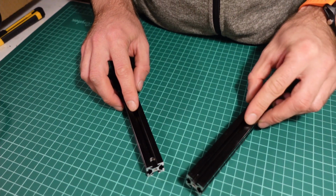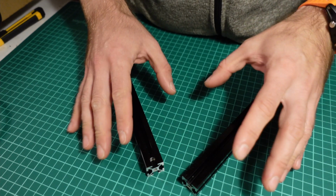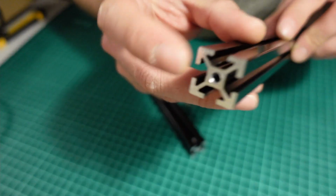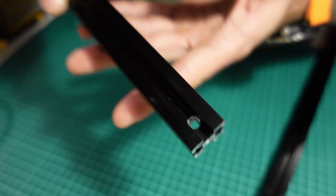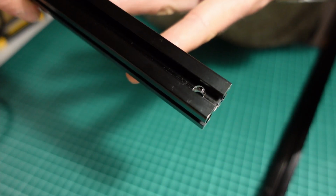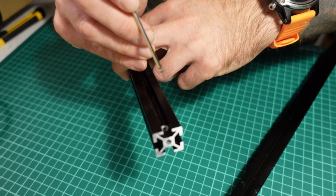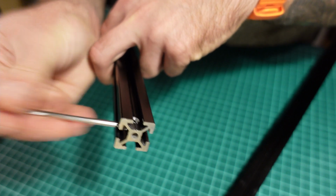Blind joints are the standard way of building Voron's frame. Blind joints means that you do not use any corner connectors or fixtures. Instead, you tap a thread into a center of one piece of extrusion and drill some holes through the other piece. The holes can be a bit off-center or misaligned. They're used only to put your Allen key through and tighten the screw.